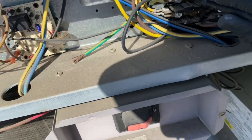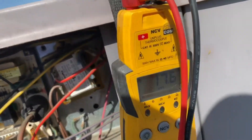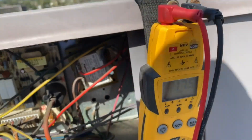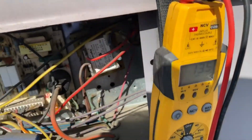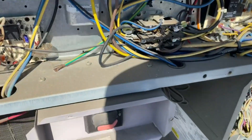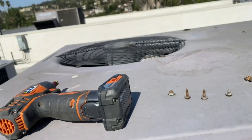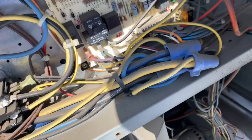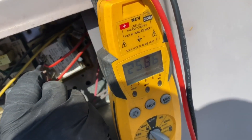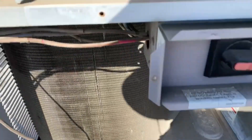There's actually no ground coming in from the service — it's just touching metal, but shame on you guys. We can check voltage drop by going across the contacts — it should be close to zero. Using the HS36, it's not showing any voltage, so the contacts are probably good. We'll ohm out the coil too. We're getting about 25.8 volts on our transformer, so that's good.